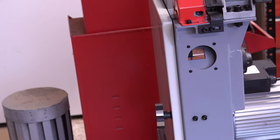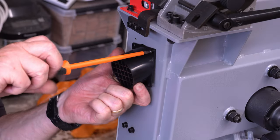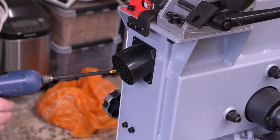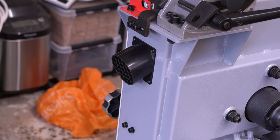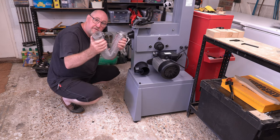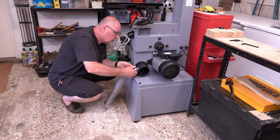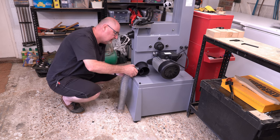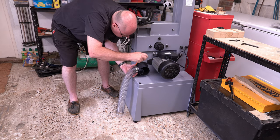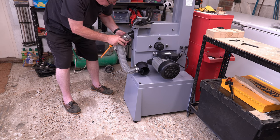The next thing is to fit the dust port — it should be pointing downwards. I'll remove these four screws; I don't want to strip the threads with my electric screwdriver. That's done. The next step is to fit the dust extraction hose between the port and the spigot. Slot the two jubilee clips over the hose and slide it on — it's quite difficult because the hose has been cut very roughly. Nip up the jubilee clips — not too tight, as we don't want to damage the plastic fitting. Do the same for the spigot we fitted.